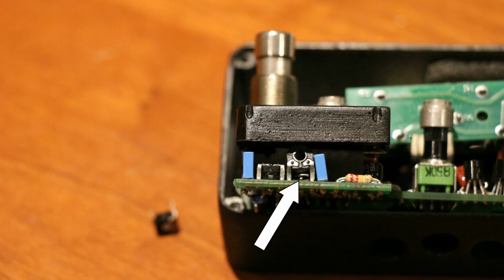loved the pedal. But what I didn't realise was inside there are two trim pots, one to control the gain of the pedal and one to control the really high frequency responses. And I didn't really realise that when I shot the demo. I opened it up and it turned out that the previous owner of this pedal had completely mangled the gain trim. So, you know, obviously that annoyed me. I wished I had spotted it before then.